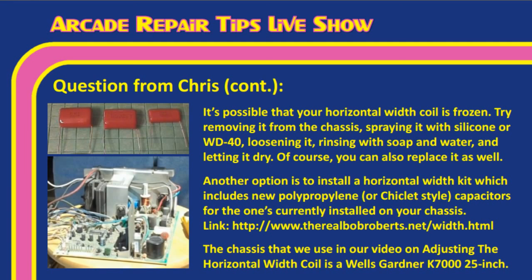Now, you can just replace it, but the problem is that getting some replacement horizontal width coils is hard. Like finding a new one of certain ones is very difficult. So sometimes it's just better to, like I said, work with what you have. Right. Now, another option, of course, is to install a horizontal width kit, which includes new polypropylene or chiclet style, like Tim mentioned, capacitors for the ones that are currently installed on your chassis.